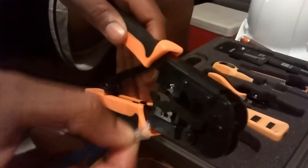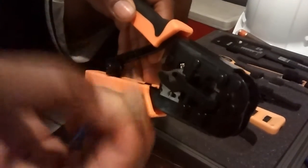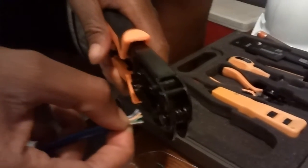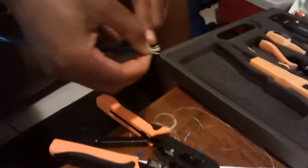You've got to be real gentle and you slide the small cables into the plug and you use your crimping tool. It has a multi-use to it. You put it in the hole — as you can see it has the size and shape of a phone jack plug. And you plug it in with your modular plug attached to the Cat5 cable. You push it down and it basically squishes the small cables into the plug.